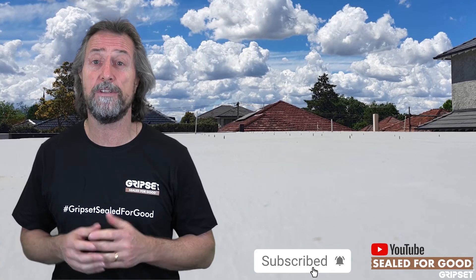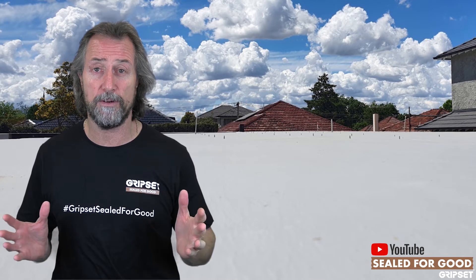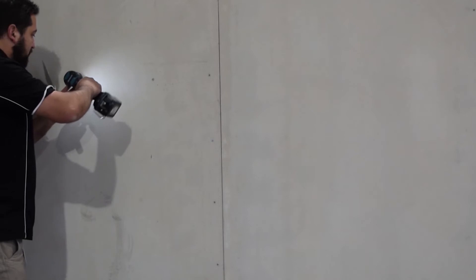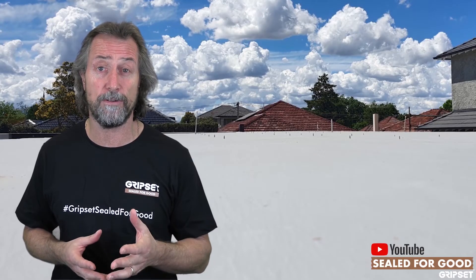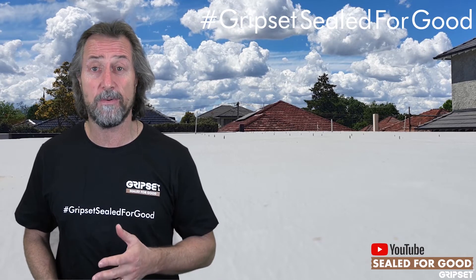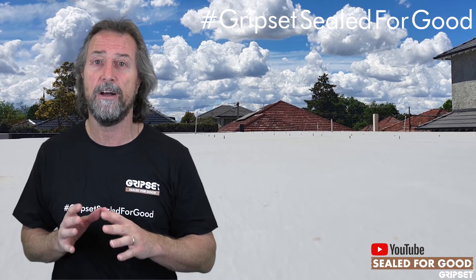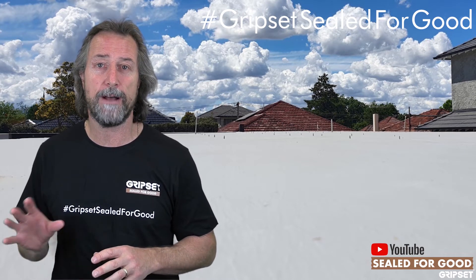A classic example from the other week: we had a job where they were using Expressor and putting it on plywood flooring — marine ply, all the right goods — however the plywood had only been nailed. Now it's always best if you're going to tile on timber that the timber is screwed and glued. You can't tell whether it's been glued into the joists, but you can take responsibility to make sure those timber sheets are screwed. That's part of surface preparation before you start priming. We told the contractor to go and screw the timber down. If the client won't pay for it, question whether you should be doing that work for them, because if they're not respecting the application, you're inheriting it and it's wrong.